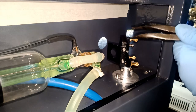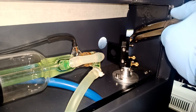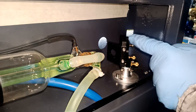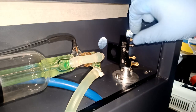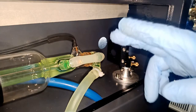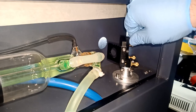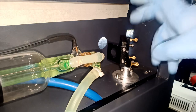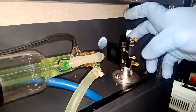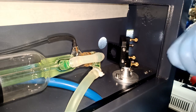Okay, first you're going to have to loosen this guy. Okay, hold. And then while you're loosening it, we're going to turn this guy just a hair, because remember, my issue is it's all the way at the end, so I did not want to make a lot of adjustment. Just a hair, I'm going to adjust it. Okay, so now we're going to tighten this guy just a little bit, and we're going to go ahead and shoot a pulse to see the difference that we made over there in the front.